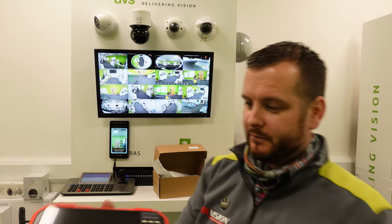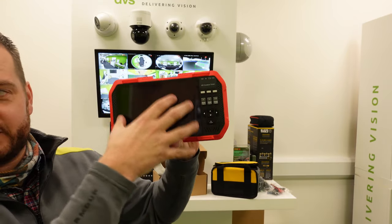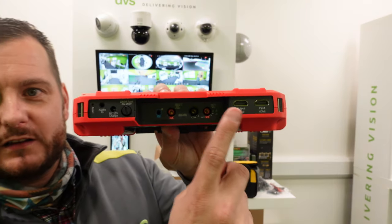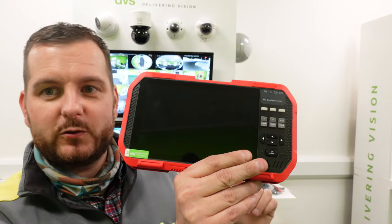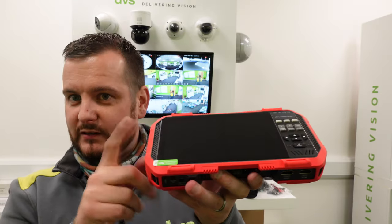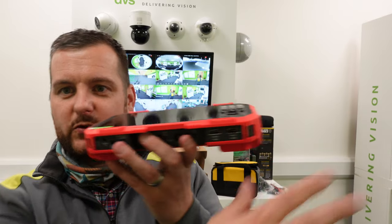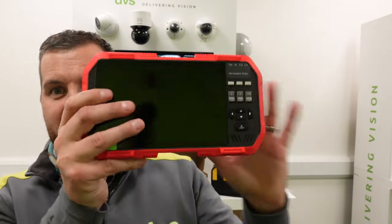The main star of the show is the test monitor. It's a touch screen monitor with a seven-inch display and physical push buttons on the side. On the rear or underside you have the test ports — for voltage, amperes, HDMI in and HDMI out. So you can take an HDMI in from a DVR or NVR and this can become your local screen to set the device up. It only supports 1080p HDMI input and output, upgraded from 720p on the older model.